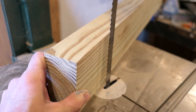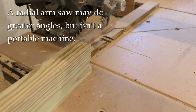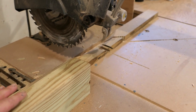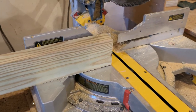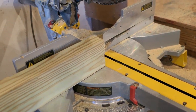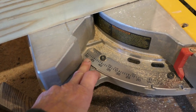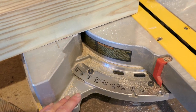However, with a band saw it's going to be freehand, and the accuracy may not be exactly what you're looking for. A radial arm saw is another option, but now you're starting to get into limitations about how far you can take that angle. A radial arm saw is capable of some pretty severe angles, but not the kind of angle that I'm talking about here. And then last, we get into the miter saws. This is a sliding compound miter saw - there are standard miter saws too, but they all have the same issue: the angle is limited. This particular one you can get up to 50 degrees, and a lot of them you're limited to 45 degrees. So again, this is not the kind of angle that I need.